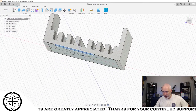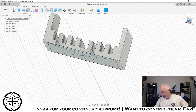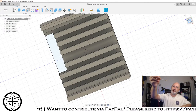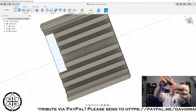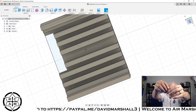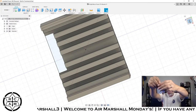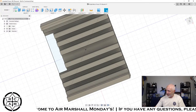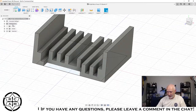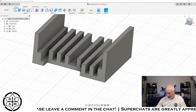And we're going to take that piece and extrude it up and cut through all of that. And that makes a little relief right there at the front where our wires can hang down the front of the VTX module without getting bent or anything, because I don't want to put any unnecessary stress on the front of the solder joints. So that was that last piece that I forgot on the VTX mount. So all of these now are ready to go to the printer at this point.